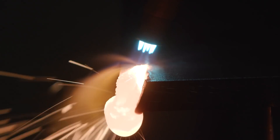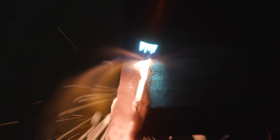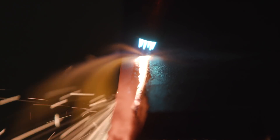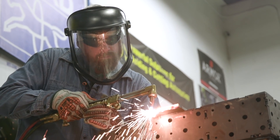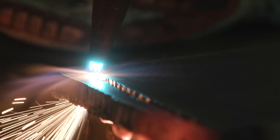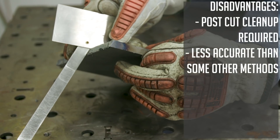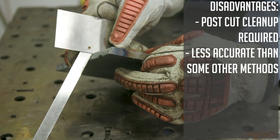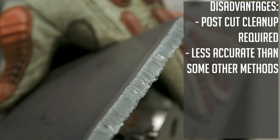So as you can see with the oxyfuel cutting, it works well. However, there are some inconsistencies in the cut. And if I put a protractor up against there, the angle's relatively close for freehanding it. Obviously you can use a track cutter to improve accuracy, speed, and repeatability on your cuts, but then we're looking at additional expenses. And sometimes they're kind of a pain to drag around the job site — they get heavy. But if you're working in the shop, that shouldn't be an issue. I would recommend if you're going to be doing any flame cutting and you want consistent results, go ahead and use a track cutter.